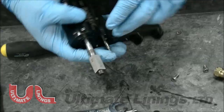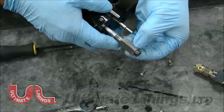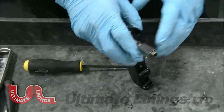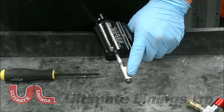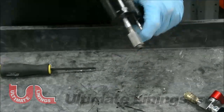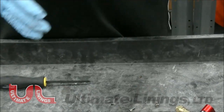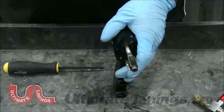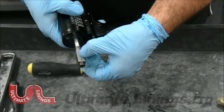That is really important. Material, especially on the ISO side, will build up on the orifice and set the machine off ratio. Believe it or not, that small orifice can give you an off ratio of almost a thousand pounds difference. The material works from zero to 500 within that range, and you really want to be between 200 to 300 pounds because of viscosity. Once you start reaching above 500, that's telling you you're starting to get a dirty mixing chamber.